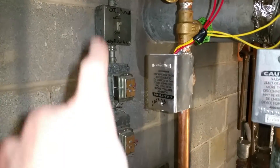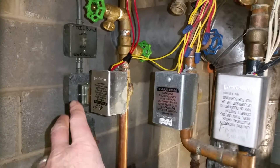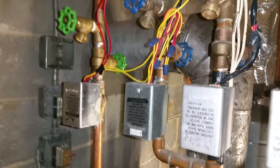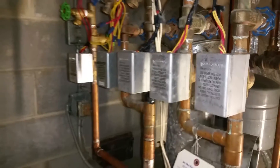Basically transformers go into the box. The box has an out that goes down to the aquastat that turns on the boiler, and I basically just wired another zone valve in. It was something to learn from no knowledge, but I figured it out and it works. I put another bleeder valve, another zone shutoff, and now let's head over to the garage.